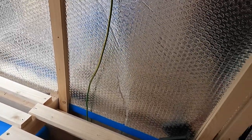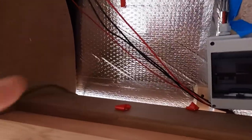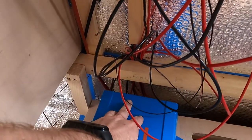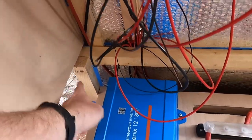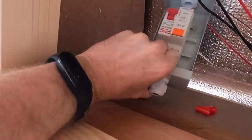The earth cable goes up behind everything and into the overhead cupboard. At the moment I've got the consumer unit for the solar panels up there, so I'm going to place my new consumer unit alongside it. The cable will come out the back of the inverter, go underneath, and come up into the cupboard along with the earth cable, then into the RCBO.